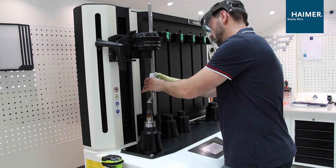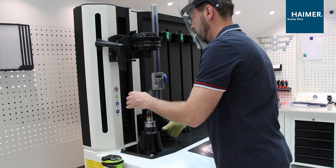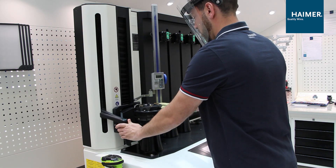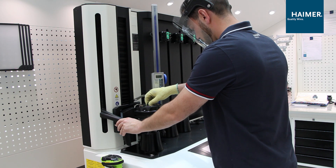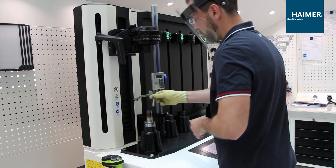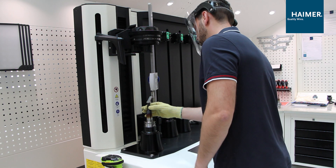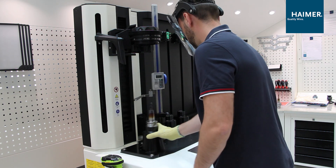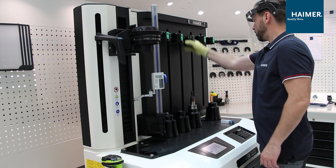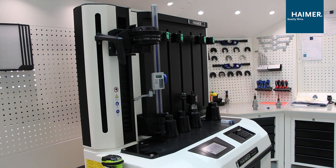He takes the length of the whole tool assembly. Now he is heating up the tool holder and changing the cutting tool. Just fit it in and preset it again to roughly the same overhang length as the last tool. Now you see the right coolant position is blinking. The light turns red — that means it's hot. Now the light is blinking — that means it's hand warm. You can grab the tool holder, and green means it's completely cooled down.